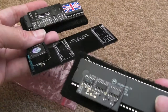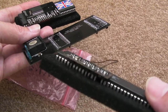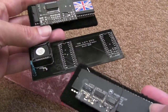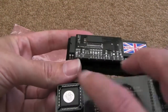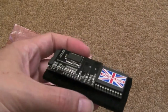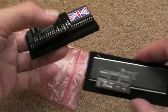Those two in conjunction give you better performance than just the straight V1. Now I wouldn't want to put anyone off the V1 — if you just want a really simple, quick and easy upgrade to 16 megahertz, the V1 is fantastic. It's the simplicity of it; you've got like one or two wires that come off it — one's for your switch, one's for your 16 megahertz that comes in from the shifter, pin 39 I think. One of these upgrades will set you back about £25 to £30-ish, maybe a bit more for this one.